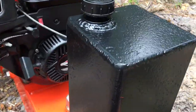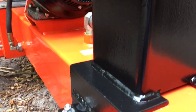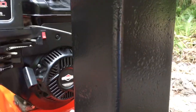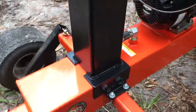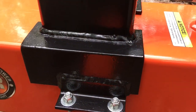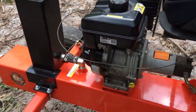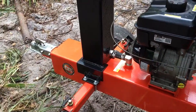I'll go around and let you see my burp tank. It's just made from used material that I acquired. I used light kit U-bolts and clamped it in place — it is very sturdy, nothing moves on it at all. I used malleable iron fittings to make my threaded connections. I did have a little trouble getting that bottom one to seal, so we ended up TIG welding it with stainless to get the final seal on that. But other than that, it turned out great — no complaints.